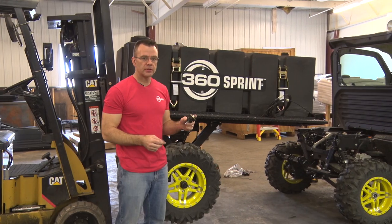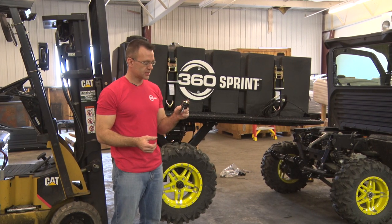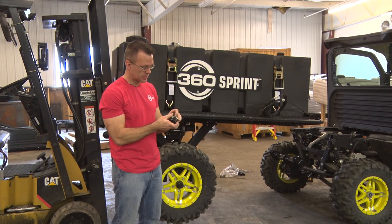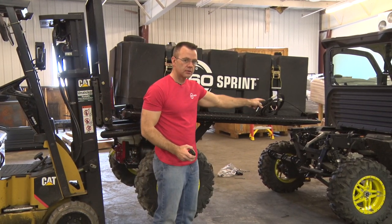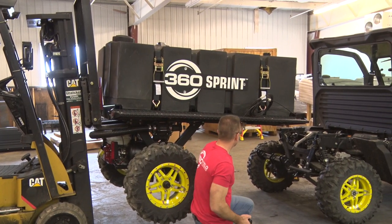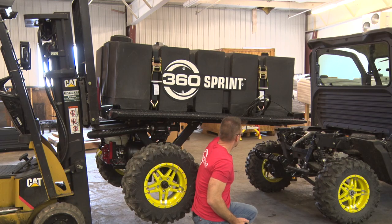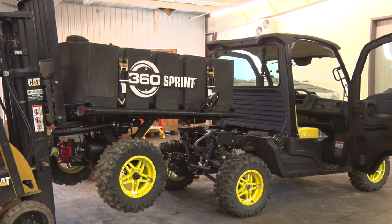Doing this part of the assembly alone, what we found works best is if you take the bolt and the small washer from your isolation mount kit that actually attaches the tank and frame to the gator brackets that we previously installed. Take the top bolt and small washer, put them into the bracket on the tank and frame. And that should help you align your tank and frame to the gator mount brackets.